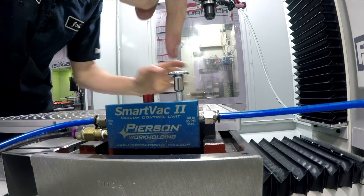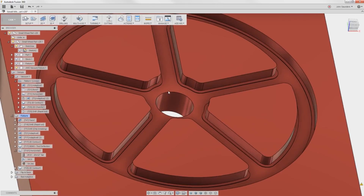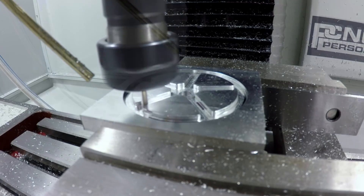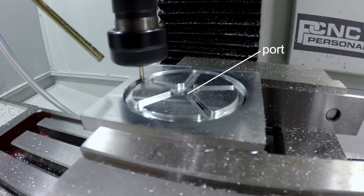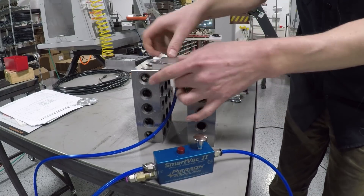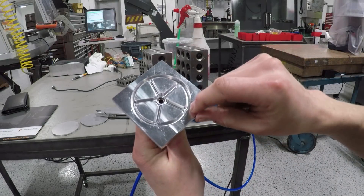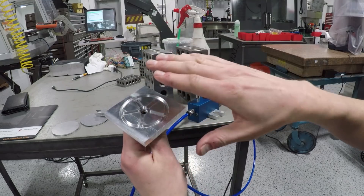This is a great trick when you need to make a small part. In Widget 139, we talk about op 2 for those same wheels. Our original plan was to machine a fixture and use a center hole as a port to hold down the parts with vacuum — a great workflow because the vacuum pulls down on your part, the fixture provides rigidity and lateral stability, and it would solve the problem of clocking the part for op 2.